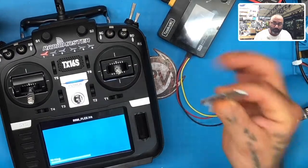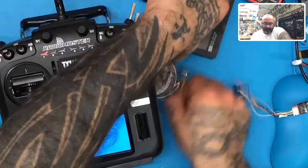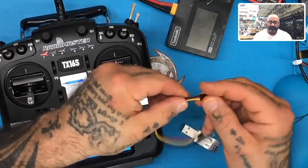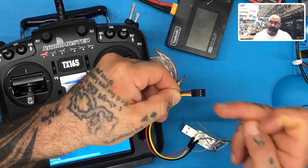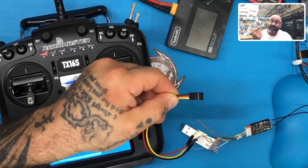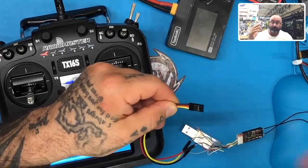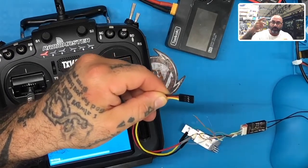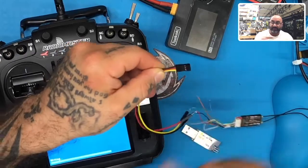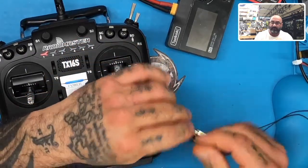If I take the module out on the back, there's the pin structure. The standard cable pinout is black, red, yellow — that's Ground, 5V, and S-Port. But on the back of the RadioMaster radio, the bottom three pins go: Positive, Ground, S-Port. So the ground and positive are reversed. If I plug the standard cable in like that, it's not going to work the way I want, and I really don't like messing with it like that.